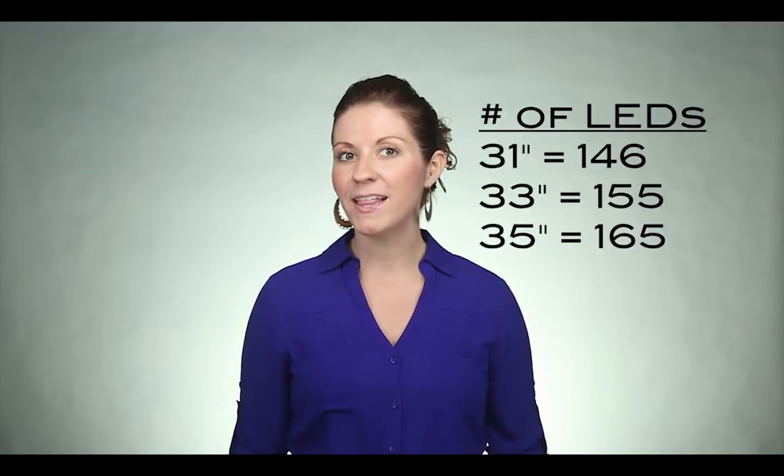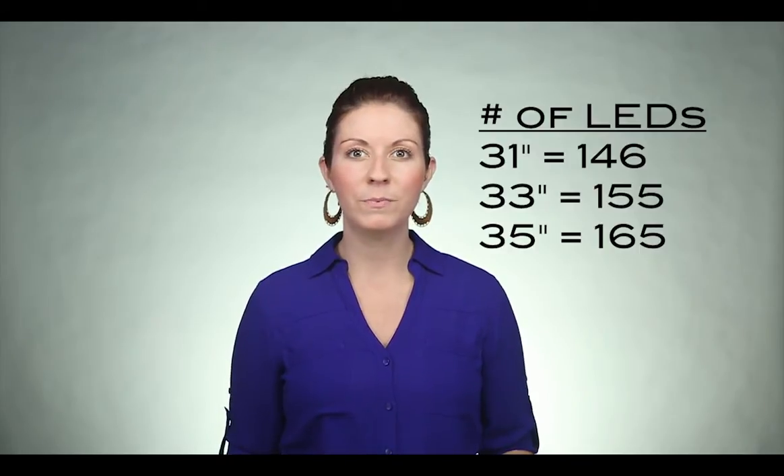The hoop reads bitmap.bmp from the internal memory. Each pixel in the image represents an LED in the hoop. Ideally, the image would be however many pixels wide as the number of LEDs your hoop contains. So if you had a 100-LED hoop, a pattern that fit perfectly would be 100 pixels wide. For simplicity, we're only going to use a 10 by 10 image, and it will work just fine. If a pattern isn't wide enough to fill all the LEDs, the hoop is smart enough to fill the rest by repeating the pattern. Many of the most eye-catching patterns are very basic, small patterns like this.